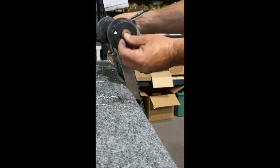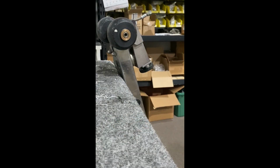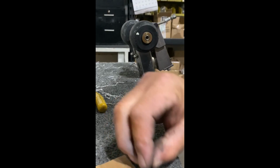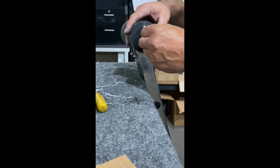Then we put our thick washers on. I'm gonna flip these over just because that side's shiny. And I'm gonna get his screws that are full of hair. We've got a washer, we've got a screw. You use your 1/4-inch Allen wrench that was supplied with your machine. So while I'm thinking about it, I'm just gonna put his knob back on here. About 1 inch of play. Let's see what we're showing. I personally put the anti-seize on the bolt first, then the washer. Saves it from going up my hands a little too much.